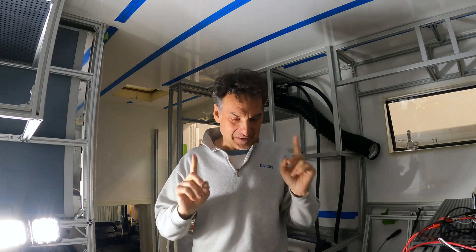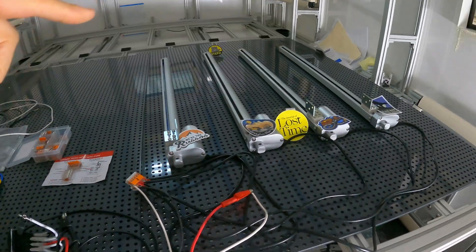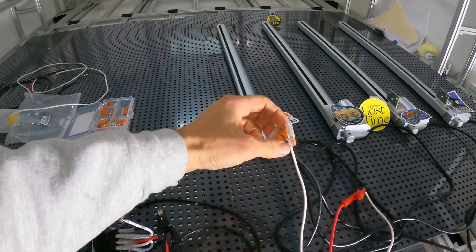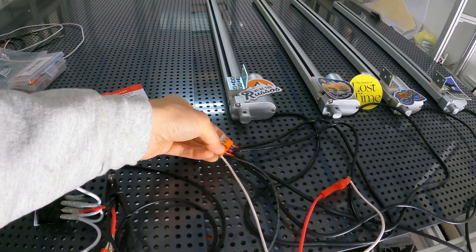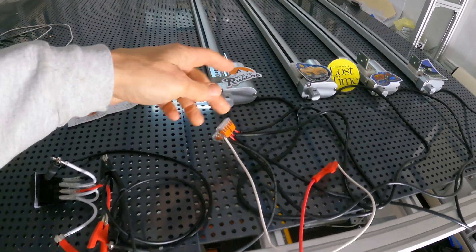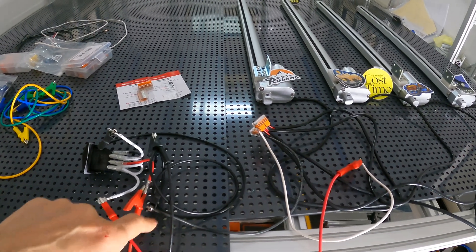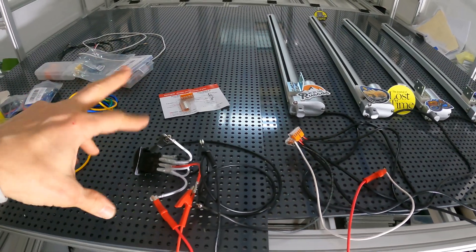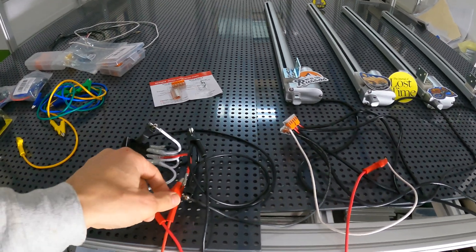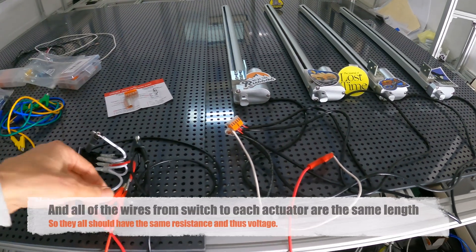So I'm going to do a speed test. Here are my four linear actuators and my single switch. I've got them all wired in — positives and negatives all into a WAGO wire combiner — so all the positives and negatives are wired into one. A positive/negative wire comes out connected to my switch with a pole connector to raise them up and down, and the actual power positive/negatives run through to all the actuators.